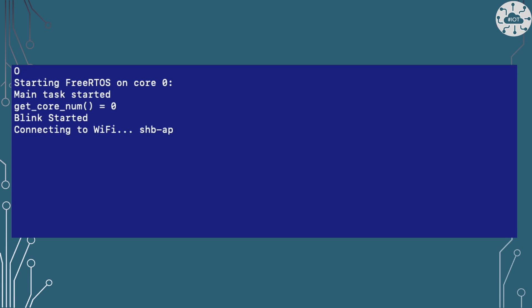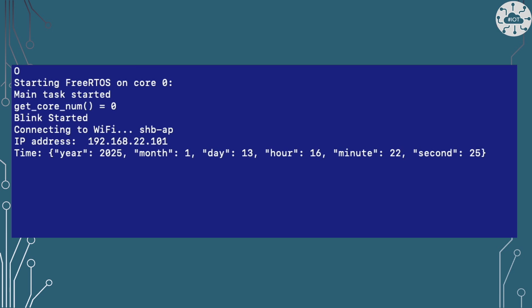So it's very simple, but it will demonstrate that we can use that RM2 module connected to our Pico 2 Plus and issue a web service call across it. I'm going to demonstrate this — connecting to Wi-Fi, my access point, printing out the IP address and getting back our web service call, all using that RM2 module.